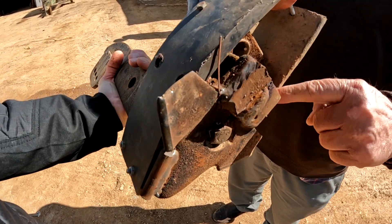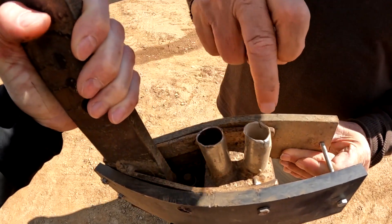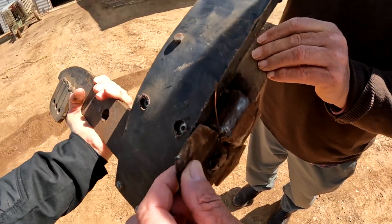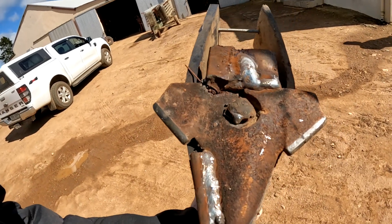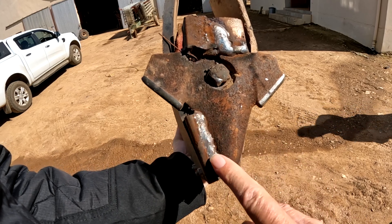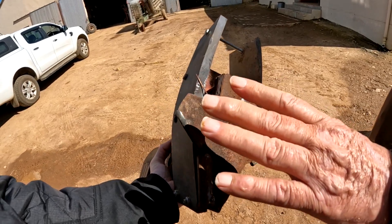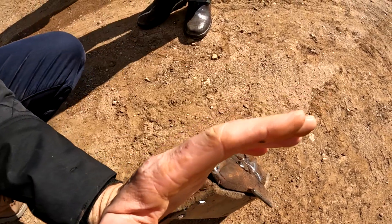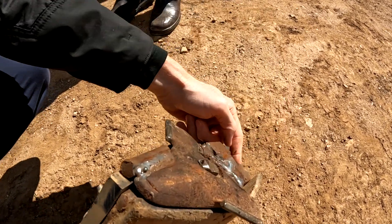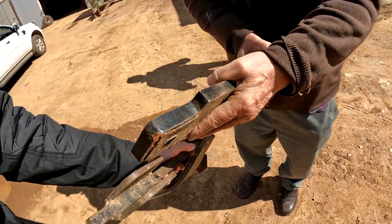This is open and the seed is getting out here and there — it's a split boot. The seed goes in there and the fertilizer goes in there, splitting out to the sides. It looks like this wing is self-made or welded — it's been repaired. This one should be removed and you've got to put a new one in. So there's a shank that opens up the ground, the wing creates a shelf, the seeds drop in behind, and the fertilizer goes down the middle.